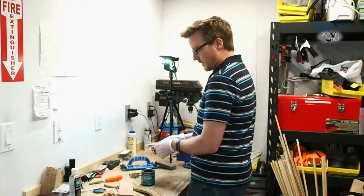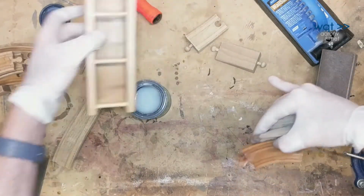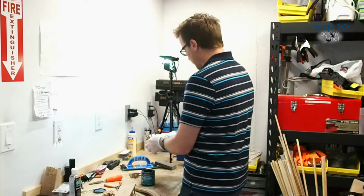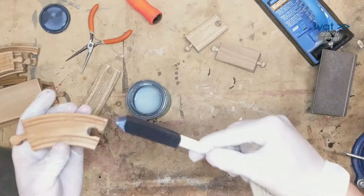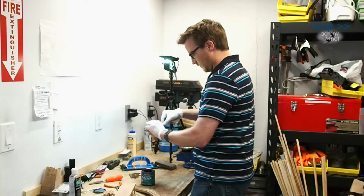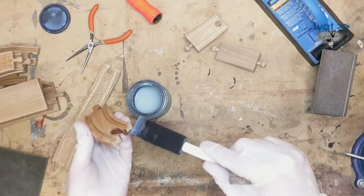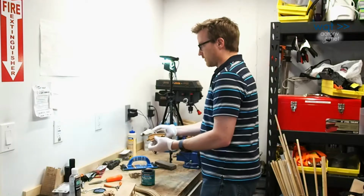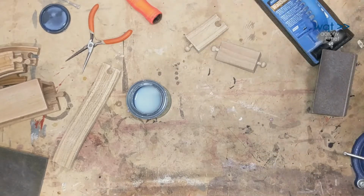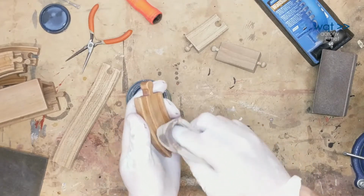Now, if you had a larger piece, like when I did this one earlier, I used the brush quite a bit on this one because it helped me get inside and out of all this area. The other thing the brush can be nice for, when you're working with a piece like this that has interlocking sections, is the foam brush is way better at getting inside an area like this. And sometimes it can even be helpful with these little track rail areas, things like that. So, you know, you've got options. Whatever works for you. I do like to save old socks in particular when I am working with polyurethane though, because you get one of these saturated, it's nice and wide, and then you just do long, gentle strokes and you can get a really nice clean finish, provided you've thinned your polyurethane correctly.